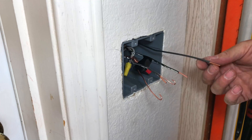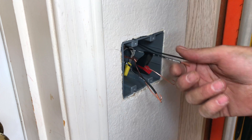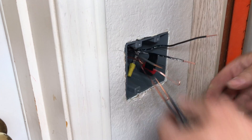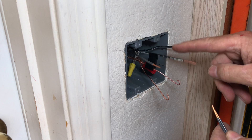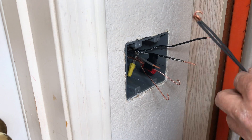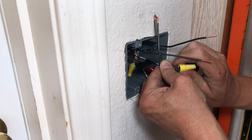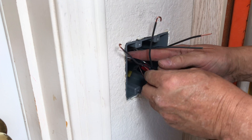For the hot wires, the one with the electrical tape on it is the line in — the hot coming into the box. I've got three hot wires: two load and one line in. I'm going to connect my two jumper pigtails to this line wire the same way — pre-twist them and use a yellow wire nut, twisting until it starts twisting the wires together. Then tuck the rest back into the box.